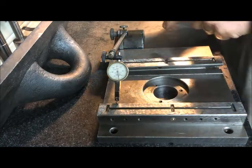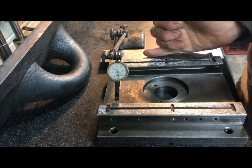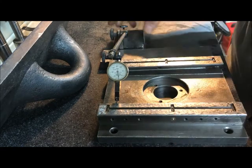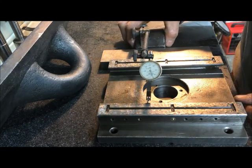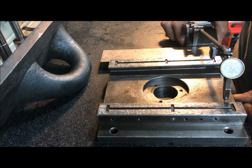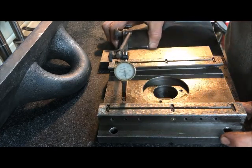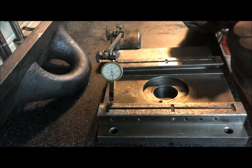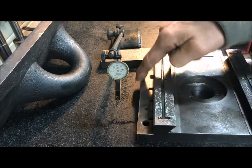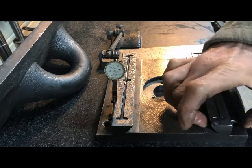One way again is just to do this the other way — to swap this to the other side, to see if this, which I'm leaning against, is faulty or not in comparison with the way here. And I can see I'm running off to that side, and it is less contact, so it is narrower as I go here. So I can't use the knowledge from that measurement — I can't use that side to prove something about the way here. I have to use that outer side, because these are in parallel.